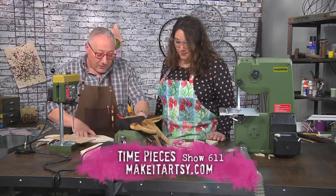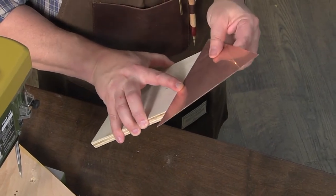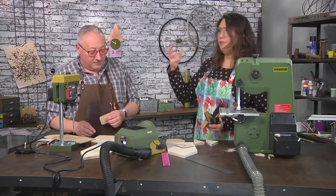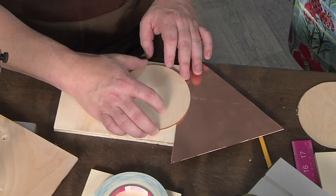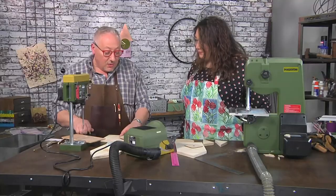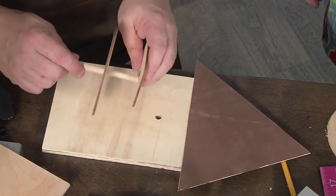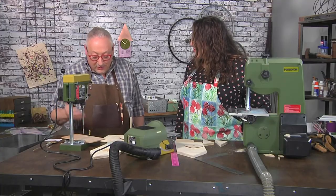Now a little trick about assembly. For the copper roof, this top part's imperfection doesn't matter because the copper covers it. I'd use a dry adhesive tape — it's fast. Lining up the layers is a pain, so here's the tip: put dry adhesive on the back, stack them on a dowel that's the same size as the hole, then basically drop it and press. They line up perfectly. Then you insert the mechanism and you have a pendulum clock.